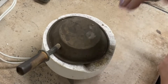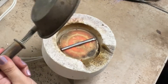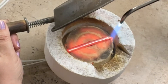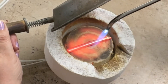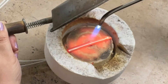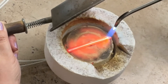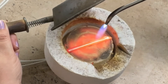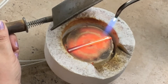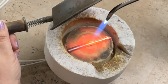If you want to see, you should come behind me, because I'm going to be using the lid and then you won't be able to see anything. Flame straight up and down. You can see all the way on the end at the left it's not all the way together, but we're going to squeeze that back together after we've got some of the rest of this tacked. That's why we need the kiln — to add that background heat. It's very hard to get enough heat with something this big with just your torch. And I just fused it! You see what I'm saying? It gets bright, and then you just see it — it almost looks a little bit like solder flowing.